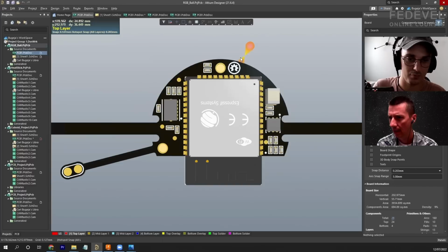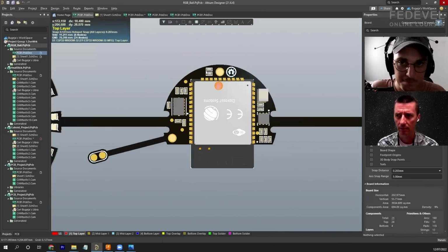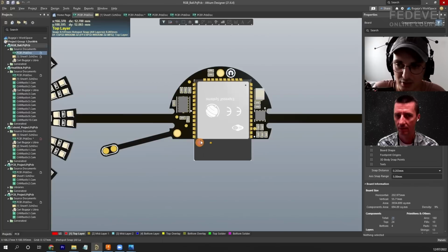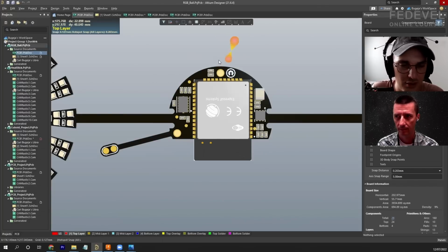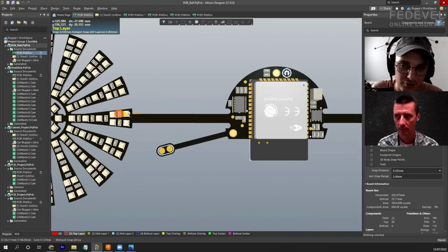Okay, and how do you drive all the LEDs? Do you need some special driver? Because it must drive quite some current, no? Or how much does one LED need? Its maximum supply range is around 4 or 5 volts, so I think it's 4.5 to 5 volts. To power it, here I had a LiPo battery. The supply of the LEDs was directly connected to the battery, and it has a different logic level as well. The logic level was 3.3 volts compatible, and the data was generated using the microcontroller.